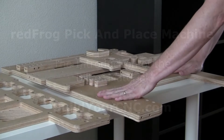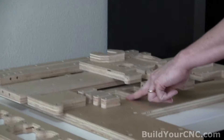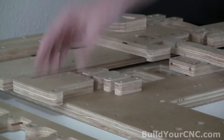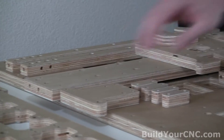This base piece is the actual top piece for the pick-and-place machine. This is where the reels will be passing — the actual tape of the reels will be passing through. This is a sunken or pocketed area for the PCBs. You'll have a part that looks like this for the Y-axis bearing holder for the rails, the V-groove bearing holder.